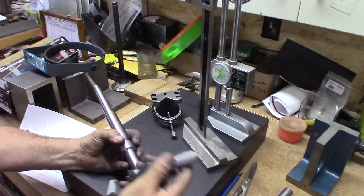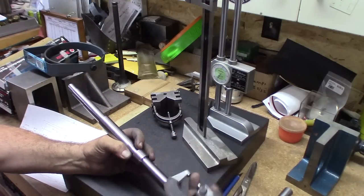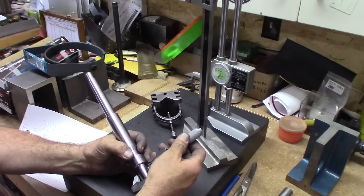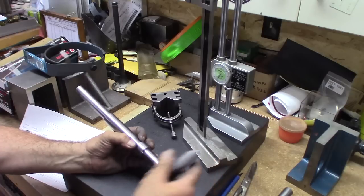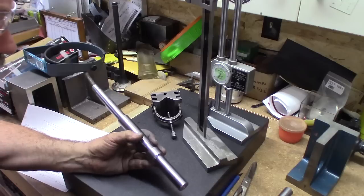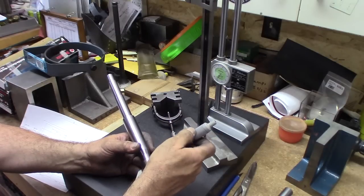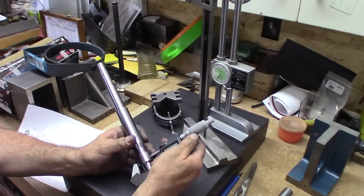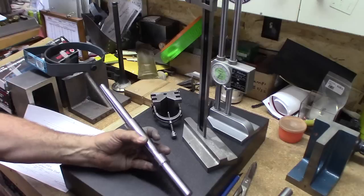So we'll start down here. So 875 was this one, and that's 22 millimeters. Okay, here we go. So we're a half a thousandth under 8745. Yep, a few tenths difference, but 8745, so a half thousandth under. This was 1214. We're still 1.5 big, 12156, so we're still about 1.5 large, which is fine.